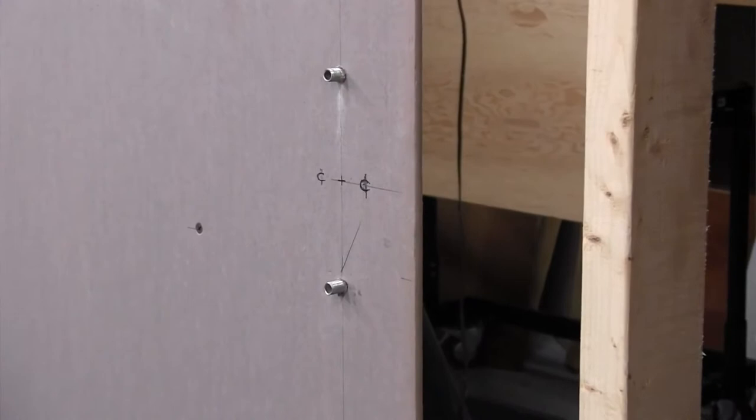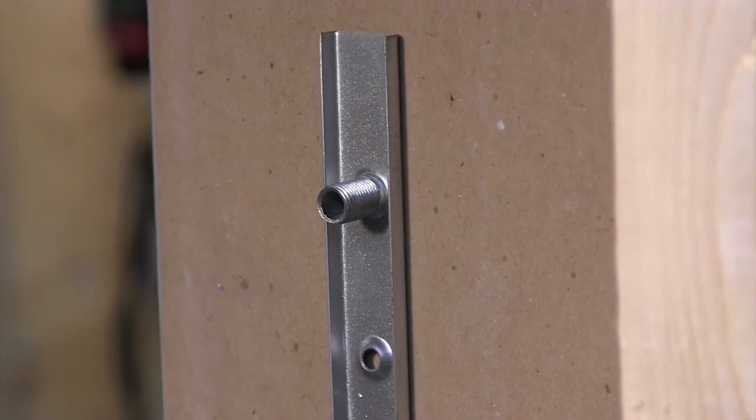Here's a brief description of the installation and how we did it. For fastening to the wall, locate the height and location of your bar, level it horizontally and vertically, get everything ready to go, then drill 3/8-inch holes through the drywall.